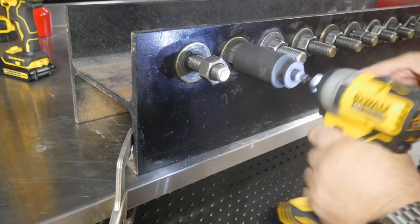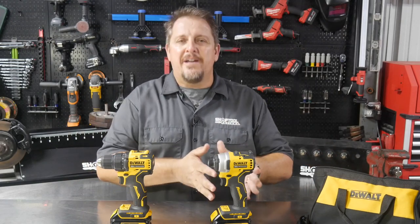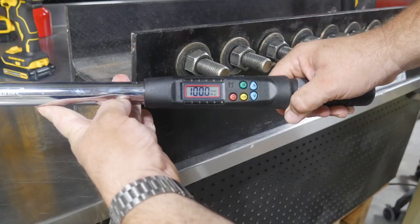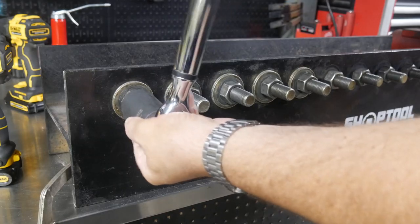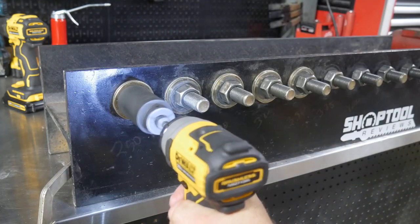When it comes to the impact driver, they're claiming 1,700 inch-pounds of torque — divide by 12, that's 142 foot-pounds of what they call nut-busting or loosening torque. Take a bolt, torque it down to 142 foot-pounds; if it backs it off, it's got 142 foot-pounds of nut-busting torque. In actuality, we tightened these down to 100 foot-pounds — no problem, took care of it. Then we tightened it down to 125 foot-pounds — again, no problem, backed them off, though you could tell it was starting to strain just a little bit. Tightened it down to 150 foot-pounds and it wouldn't loosen any of them, even after holding it on about 10 seconds. So we backed it down to 130 foot-pounds and it backed those off. It wouldn't go higher than that, so we claim 130 foot-pounds — 130, 142 — we're fine, that's in the same ballpark.